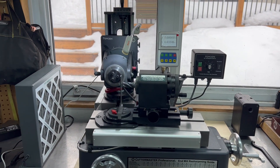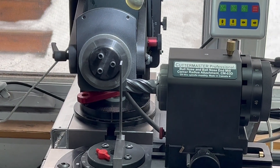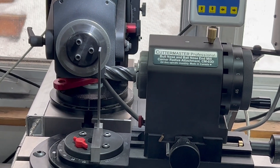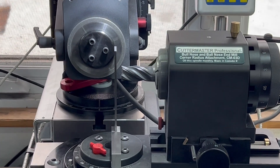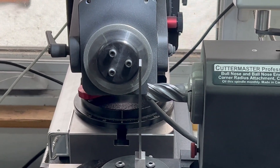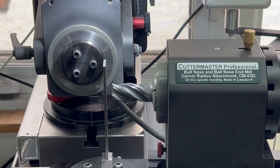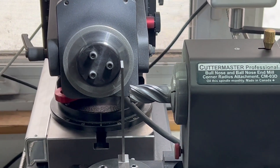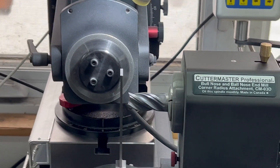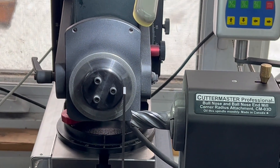What we're doing here is using our new Easy End setup, which makes it a lot easier to do the end of the end mill with a rigid edge profile rather than the side of a tapered cup. We've got a plated bond diamond wheel — you traverse the end of the end mill at whatever height you want given the angle you want, and then when it's time to do a center gash, you just lift it up and plunge the gash, taking out the center of flutes two and four, or whatever your choice is. Really easy to do.